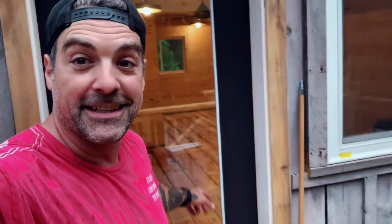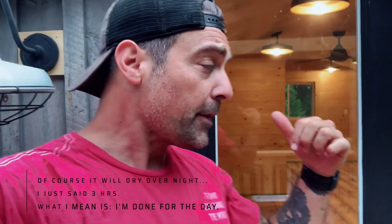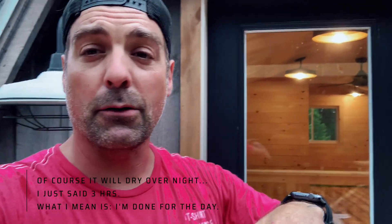First coat is down — sorry for the reflection. Obviously you have to paint yourself out. I forgot the camera was in the refrigerator cutout so a little iPhone catch-up here. Went down super easy, floors look incredible already. I think it's going to be three coats — this pine's been super dry, it's been up here for years never been touched, so the first coat is really going to soak in. The nice thing is it's an hour to dry, two to three hours and you can do another application. Not great to put this stuff down in a very humid environment — you don't want over 50% relative humidity.